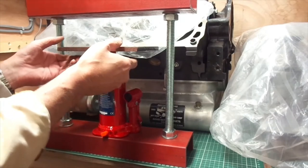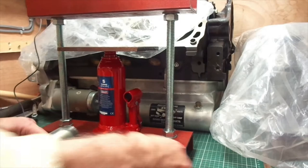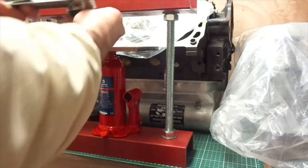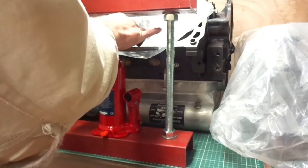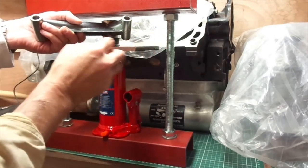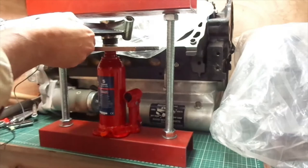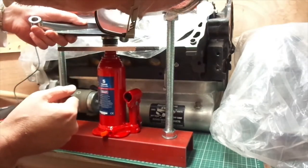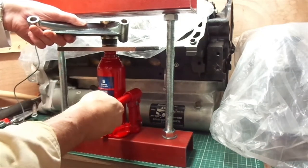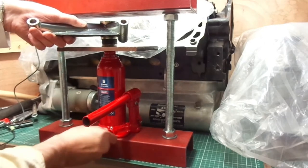Last nut and washer just going on. Let's also add a 5-ton hydraulic car jack and a piece of 10mm thick steel plate precariously balanced on the car jack. We're back in the room with the engine mount. Two M20 washers going underneath it — there's a slightly larger boss on the inner boss which I need to protect. I don't want to be pressing it in on that, I want to be pressing it on the outside of the sleeve. So I need to make sure it's aligned. Remembering to shut the valve as well so it'll actually work.